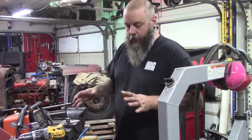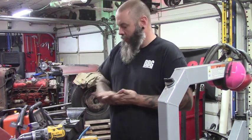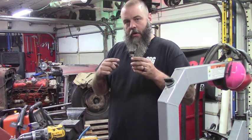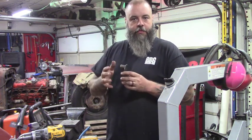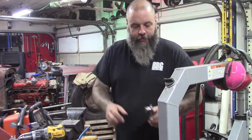At this point we're going to do the final assembly before I even mount it on the door, because I want everything together so I can see what's going on and where to place it. Between the first piece of tubing and the second one is where you need to apply some grease — that's where you don't want any friction. You want it nice and smooth; everything else don't worry about, just that one area. Definitely want some grease in it.